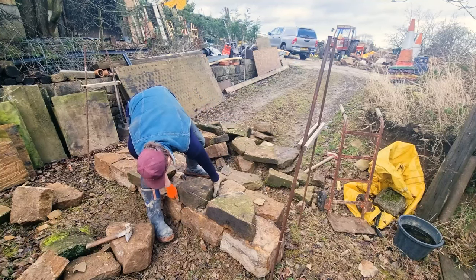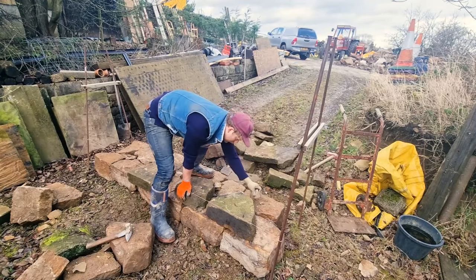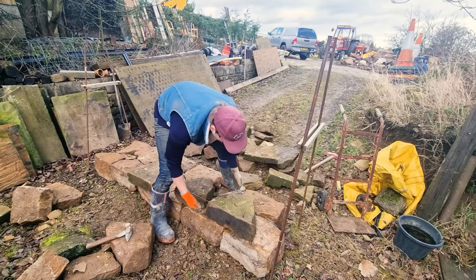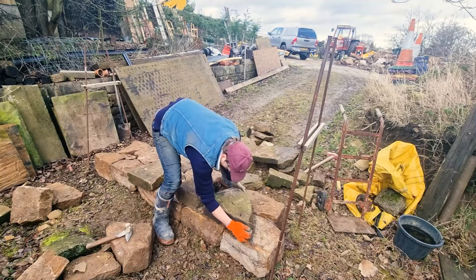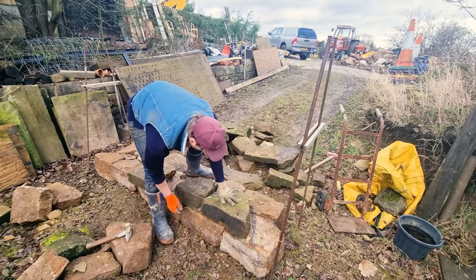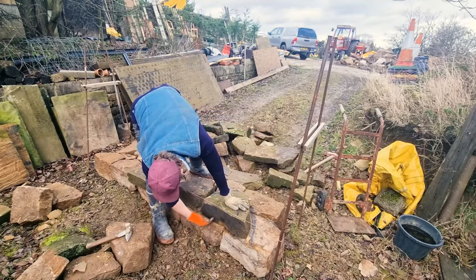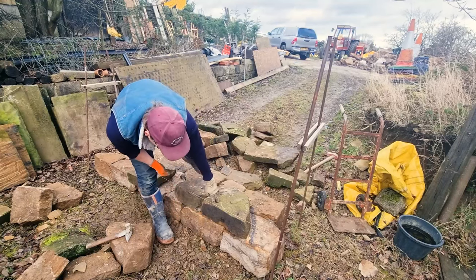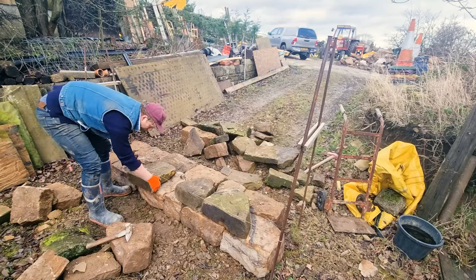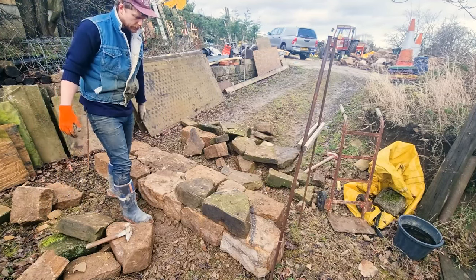Right. So that sits very nicely now. Just needs a pin on the back. Perfect. Now, because this stone's so broad, I've got the chance to just shove it up this way. Still crossing nicely there. It's actually more than halfway there, but it's just coming a bit further across on that stone. So there. That's two stones walled.